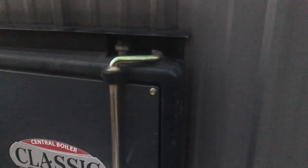Alright guys, we're back over at the Durbin Compound. One thing I want to cover is the door seal — make sure you're getting a good seal around the door. Excess oxygen that gets into the firebox during a fire will allow it to burn more wood unnecessarily. What I use is a piece of paper — an old bill works fine. Open your door, put the piece of paper in, latch it back down, and you should be able to pull the paper out with resistance. Do this all the way around your door to make sure your door seal is good. Obviously if you have a fire in the firebox, don't leave your piece of paper in there too long.